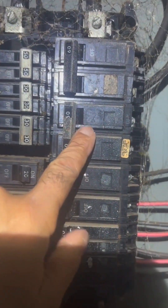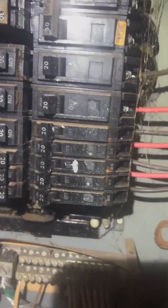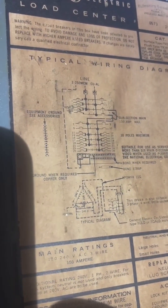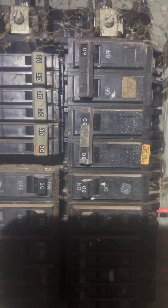This breaker feeds general lighting for the house. Another clue — GE usually has these. You look at the schematic, and as you can tell, this is the upper half feeding the lower half of the panel. That's what also makes it a split bus panel.